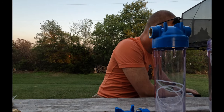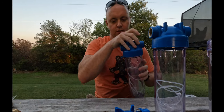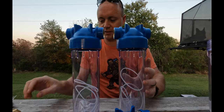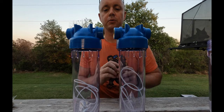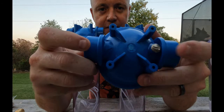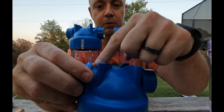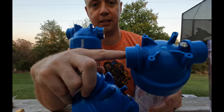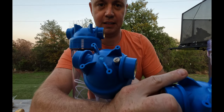The concept behind assembling these is that there's an inside and an outside to each housing. What you do is go in to out, out to in, and then out to in again, so that the water flows in one correct direction through all three filters.